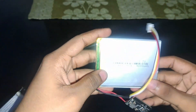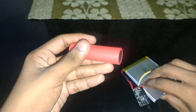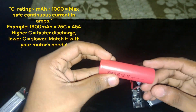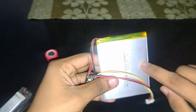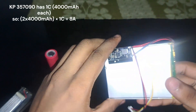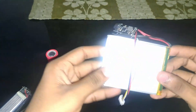The problem with lithium polymer batteries is they can get damaged and if they do, they will burn — there is not a lot of protection. Lithium-ion batteries are more rigid and can withstand a fall. However, a problem with lithium-ion is you cannot discharge it very fast, so you have to look for the proper C rating. Around seven to eight amps are needed for those Chinese drones, and lithium polymer can usually provide a high drain capacity of 30 to 40 C.